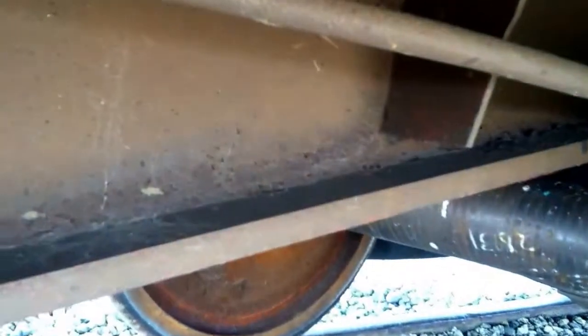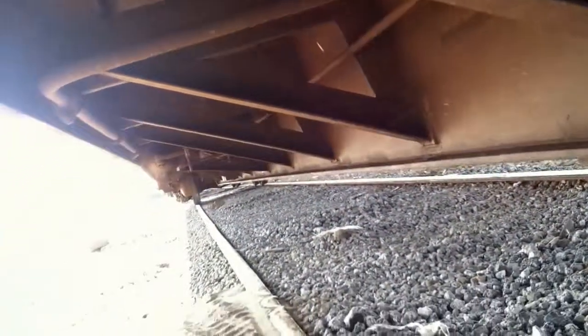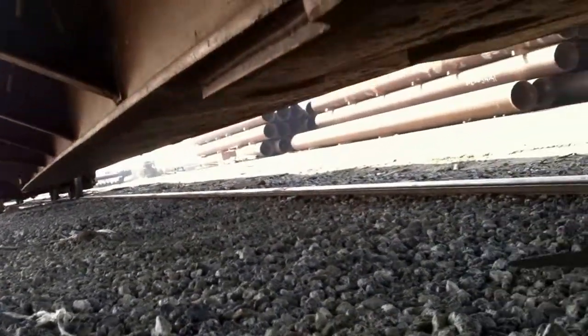This brake rod right here will actually be disconnected — that's really the only thing connecting the rail car to the trucks, so we'll torch that. This is the second crossmember, almost identical to the first. That's the X1 crossmember, except it has a bigger gusset connecting the crossmember — we call that the X2 crossmember — to the center sill. The center sill is that main beam right over here. The third crossmember we'll call X3, same as X1 and X2, C7 by 12.25, except these have a kicker, usually a 4x4 by 3/8-inch angle iron. All the crossmembers look fantastic. There isn't any damage at all on this car. That's a really nice and straight rail car.